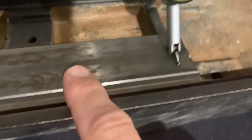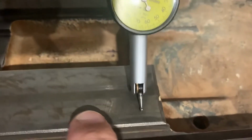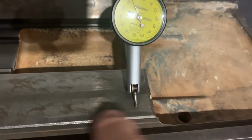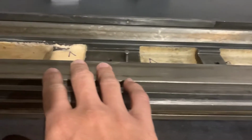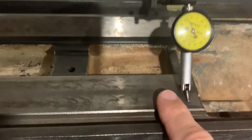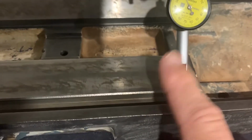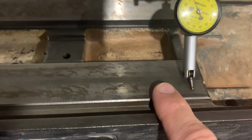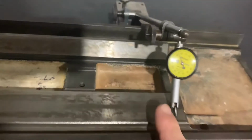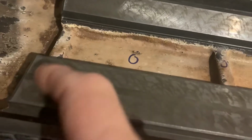They're visible right throughout until you get right down the end here, where your flake marks start to disappear. Now, normally you'd see that on a mill occur in the middle. The ends through here will be caused by the ingress of abrasives. It's pretty typical. This side here, away from the workhead, is obviously a lot better.